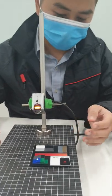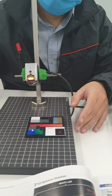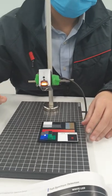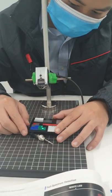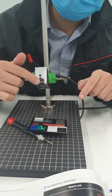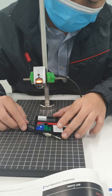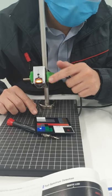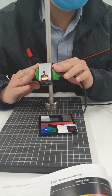That means this one can withstand good vibrations. So let's say you have a conveyor belt right here, and when the conveyor belt moves, it creates some vibration. So I will use my screwdriver to simulate that vibration. I will put it right here. So when there are no objects, vibration. Very stable. When there is an object, then vibration happens. Very stable. The light will not be on or off. Okay. So very stable under vibrating conditions.